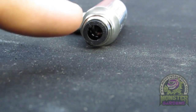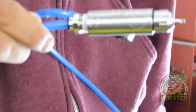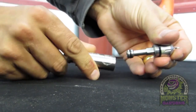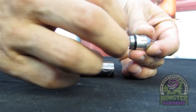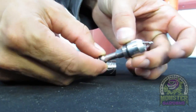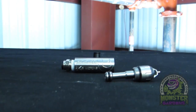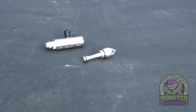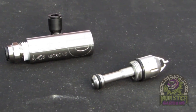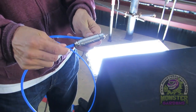Water goes in here and the compressed air goes through the backside. If you ever have a problem, all you have to do is unscrew the top, take a wrench and unscrew it, pull the orifice out, and clean it. Inside there are a bunch of little holes where the water is siphoned into the jet stream of air, and if those ever clog with a root or some particle you can just clean them out with a pen or something. Both connections are quarter-inch push connect.